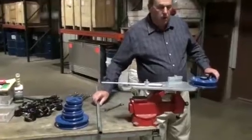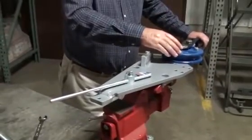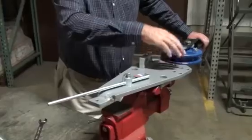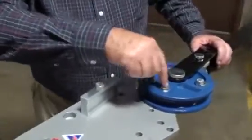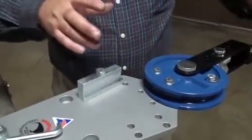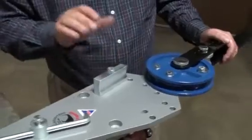To operate the unit, first of all mount the correct size of former according to the diameter of tubing on the front of the main mounting plate. There are two positions here by the holes we've used in another set. That other set is for the larger diameter formers to allow it to be as close as possible to your other clamping components.